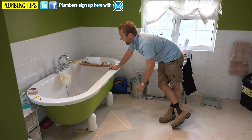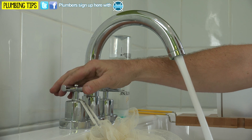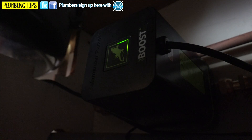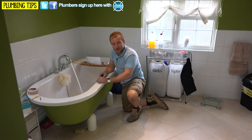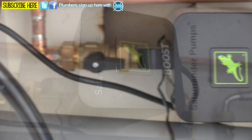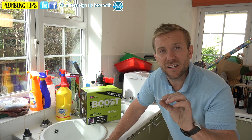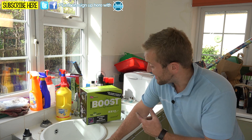Well earlier the bath was pretty lackluster. Let's whack this on — you can already hear how much better it is. That's already coming through hot as well. I'm absolutely amazed. You're going to need to ask Salamander pumps how they've made this happen. So the Home Booster is installed nice and easily. If any of your customers have got a problem with their water pressure, definitely consult Salamander — we'll leave a link to their website in the description so you can get hold of their technical team. They're really helpful deciding whether you need one. If you've got mini isolation valves in the line, take those out first. If you've done all that and still have a problem, this could well be your solution.